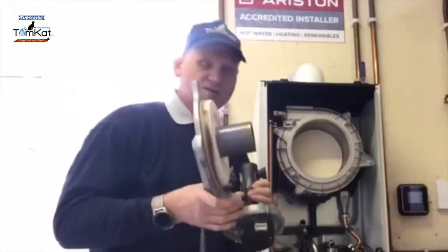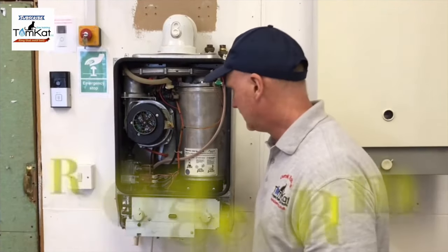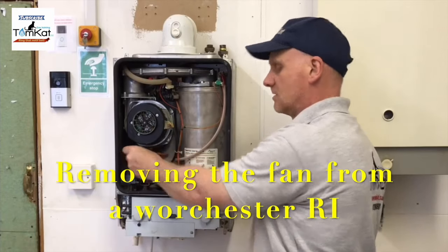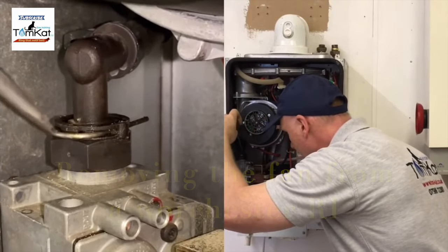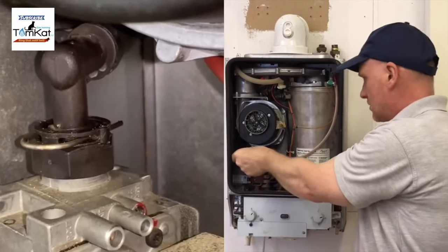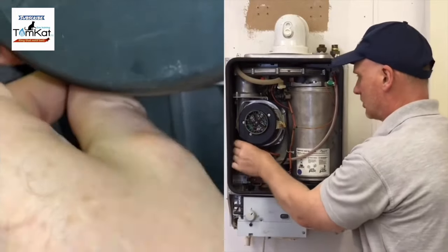Okay. So that was how easy removing the burner was. Turn the gas off for it. Now, first thing I need to do is remove this pin here. So, let's get a flat screwdriver and get this pin out. Okay, so quite easy. This is a quick release on the gas. So the pin comes out, and this gas pipe now pulls off.